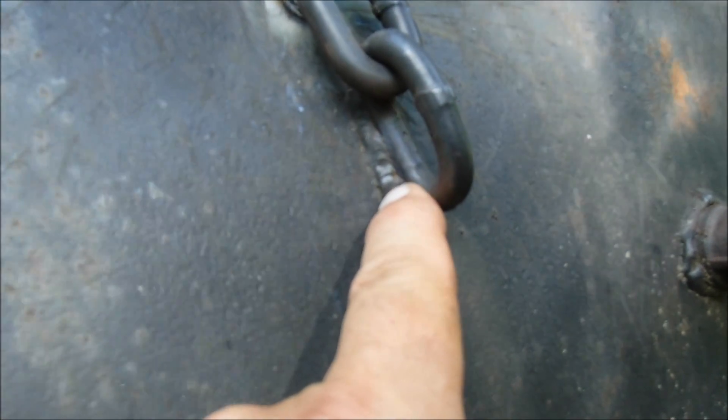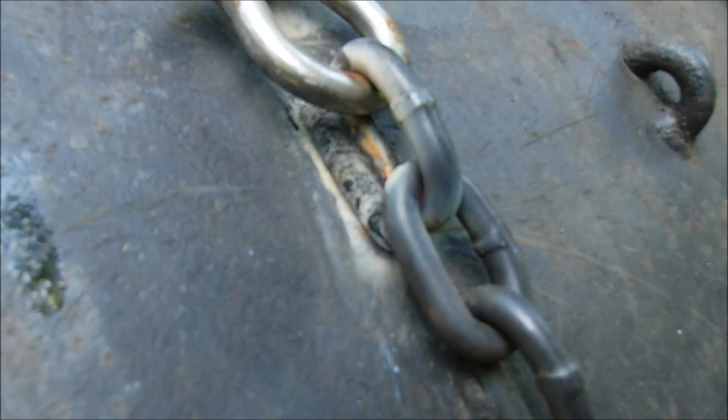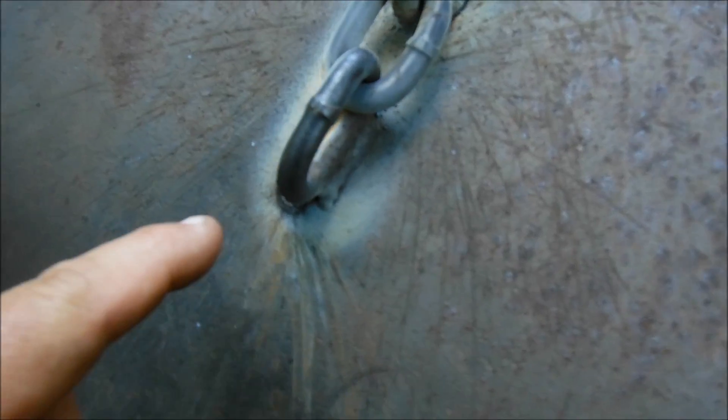And for the welding, used a flux core welding machine. This weld here was made by a $100 flux core welding machine. This weld here was $400. That one there was like a three-sixteenths weld, one-eighth weld. This one right here is a nice quarter-inch fillet weld — same thing over here. I need to take a wire brush and buff those up a little bit. I'm going back over some of these welds and putting a little bit more weld on them.